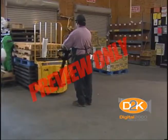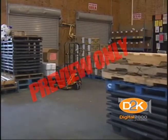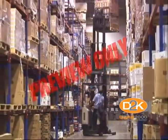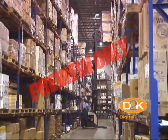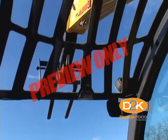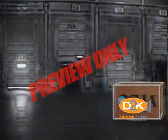If the type of load presents a hazard, the user shall equip fork trucks with a vertical load backrest extension. If you're lifting loads high, this backrest should be in place, and an overhead guard should be installed on your lift truck. This is designed to minimize the possibility of the load or part of it from falling rearward. An overhead guard shall be used as protection against falling objects, such as packages or boxes, but it is not designed to withstand a falling capacity load.